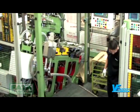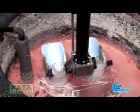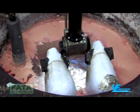When the moulds are closed, the bench authorises the robot to descend into the furnace. The level probes cause it to stop, then the bath is skimmed in order to take off the alloy without oxide skin, using the ceramic lined casting iron ladle.